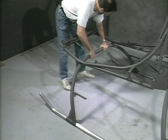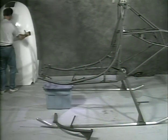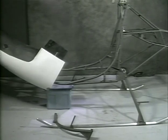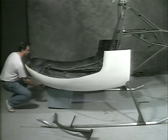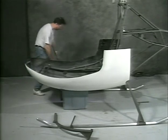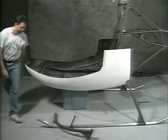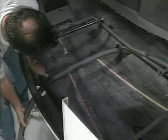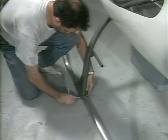Disassemble the front landing gear and install the halves through the holes in the tub. Prop up the rear of the tub or have someone help you during this process. Install the front landing gear on the skids and airframe. Reinsert the landing gear bolts.